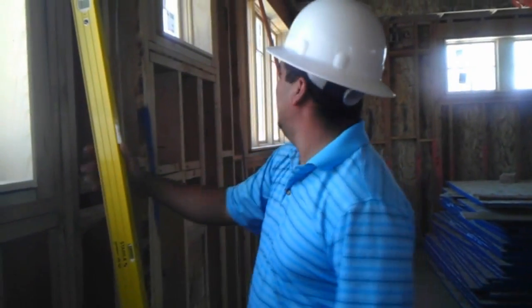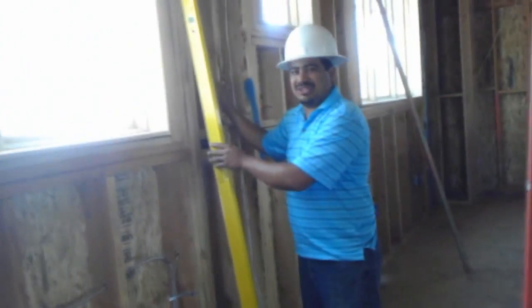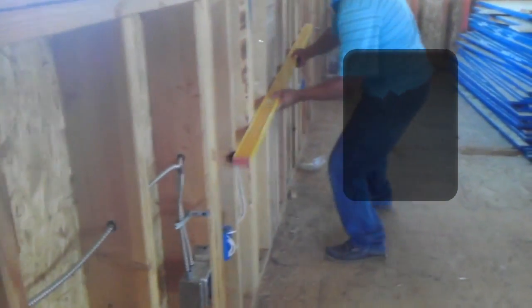In this video we're going to talk about the straight edge. If you guys aren't familiar with framing and you use stick framing like we have over here, balloon framing — the walls, by the time you're framing them and you're getting ready for sheetrock, should be checked to make sure that they are straight. Wood over time will warp and twist and bow, and as it's drying it will shrink and make even parts of your wall uneven. When we're checking for the straight edge, we're making sure that your wall is completely straight before you put the sheetrock.